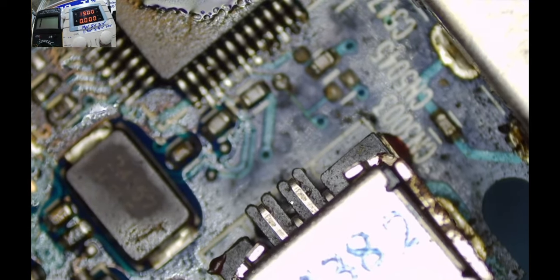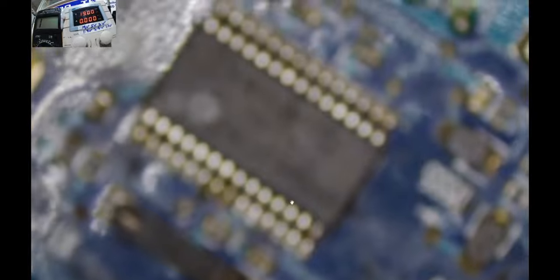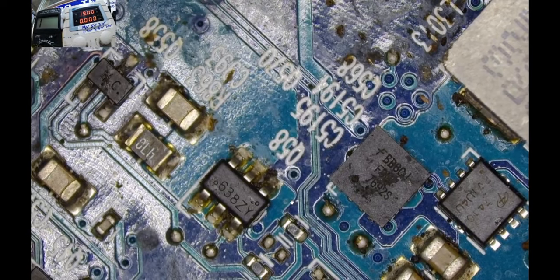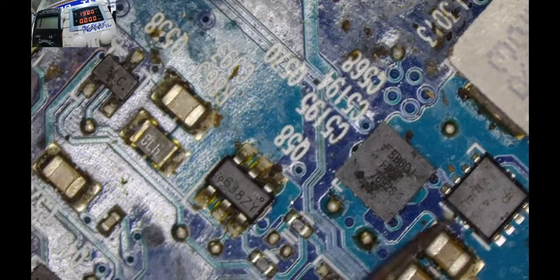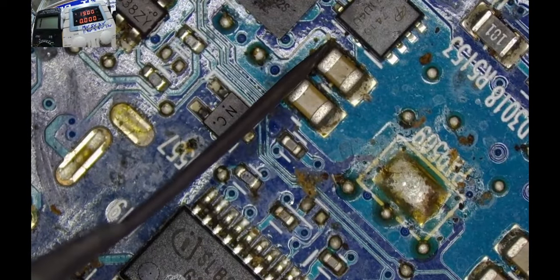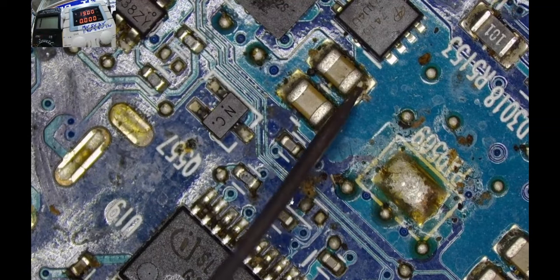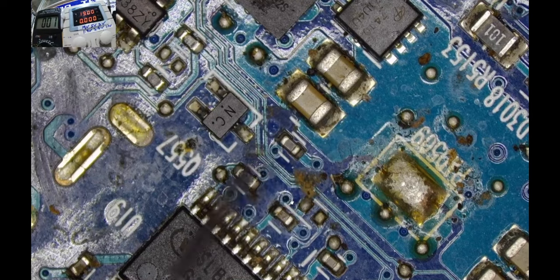I can see there's some resistance. Yeah, there's a value here. Hey, this is a short circuit here. There's a short circuit, guys. We're still having a short. And I hope you can still see that the motherboard is still having a lot of dirt from our guys Joey, Mark, and D, the cockroaches. But check out here, guys. There's a short here. Check my multimeter. There's a red light coming on. The LED light indicates there's a short on both sides of the capacitors.